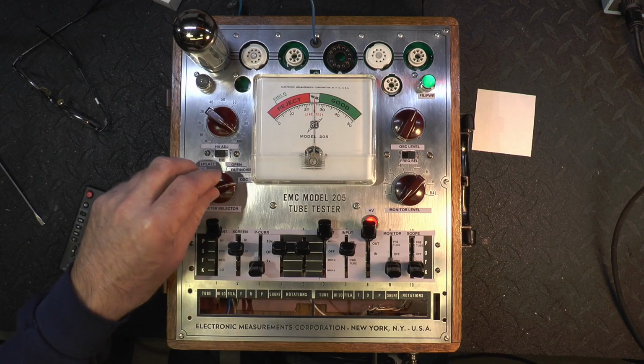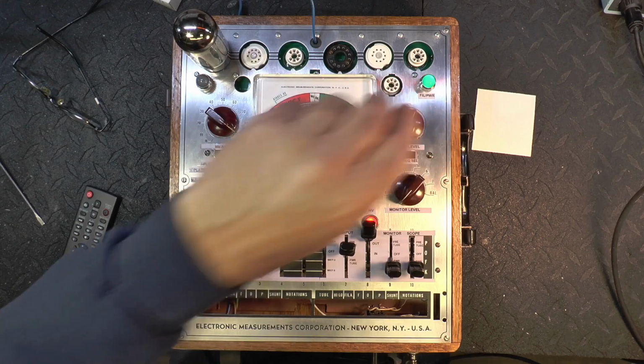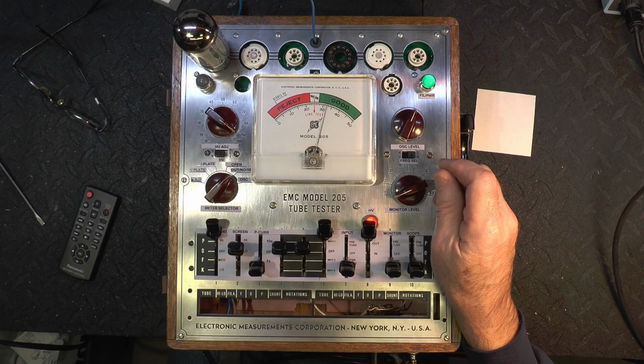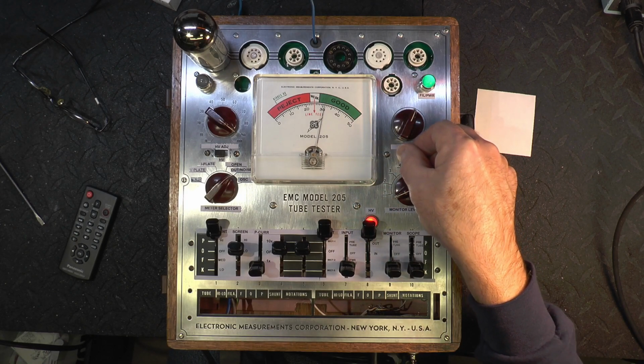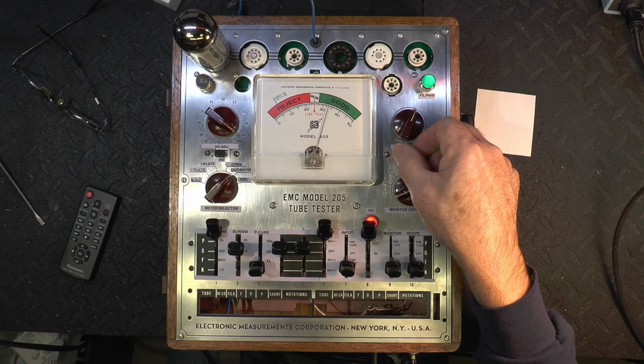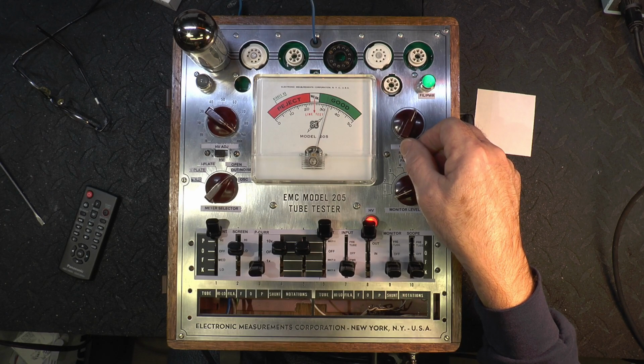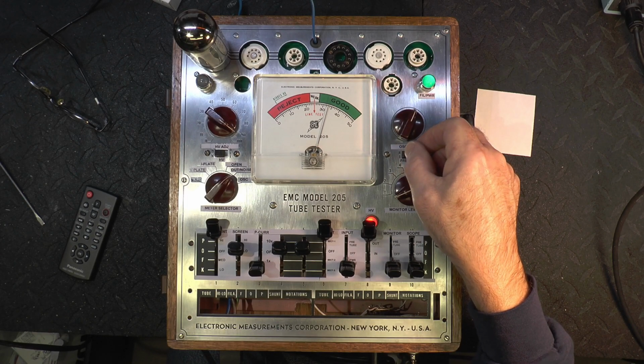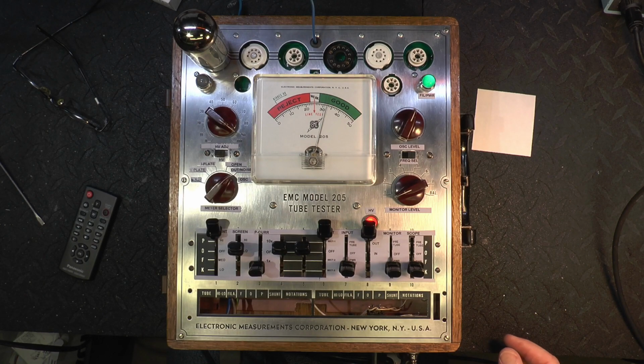And we set the oscillator level, and we measure the output here. That's at 1,000 hertz, and we're sitting at about 32, right on it. At 10 kilohertz, it's got a little bit of a boost to it. Now there is an actual plate transformer set up single-ended on these power tubes, so the frequency response of that little transformer probably isn't the best, especially at the low end. But that's why I pretty much just use 1,000 hertz as a reference, and everything can be referenced to that to test these tubes out.